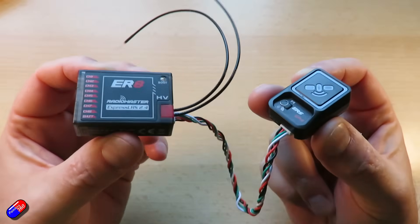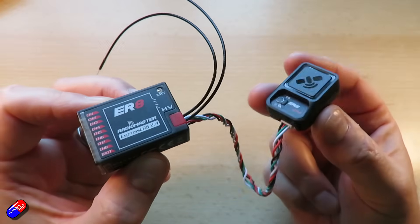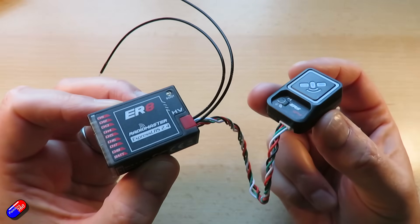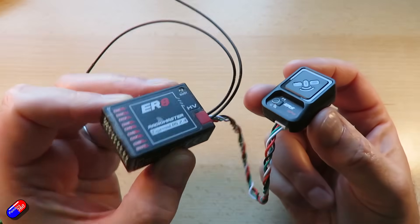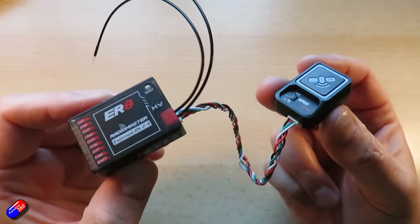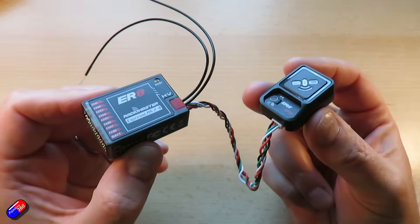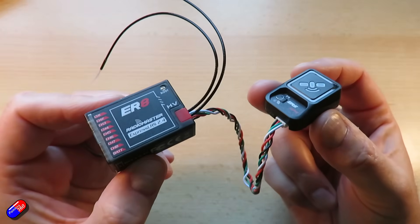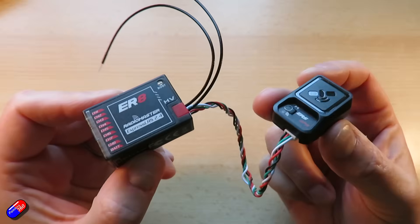Who is this really good for? For those using a flight controller with GPS already plugged in, this is not as good in my humble opinion, because you get superior telemetry when the receiver is connected to a flight controller. However, if you're using the ER series with PWM pins — plugging in servos and speed controllers — you're probably playing with a model where a flight controller is less relevant. Now you can add GPS capability cheaply and easily, either for location and altitude or speed.